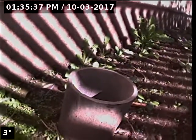We have a 4-inch ABS cleanout as our point of access. It does not have a cleanout cap on it, flange or cap. I would highly recommend getting one of those installed so debris doesn't get down the cleanout here and clog the line. Anyway, we're going to check out the overall condition and serviceability of the sanitary sewer line. Currently have water running. Here we go.